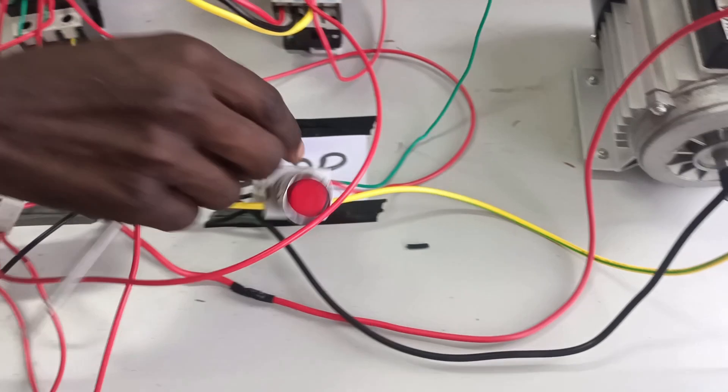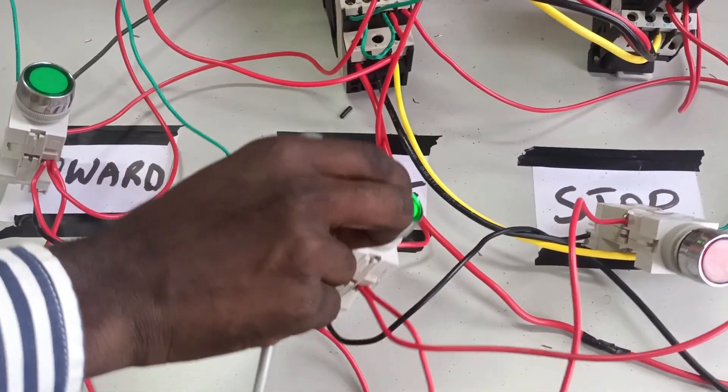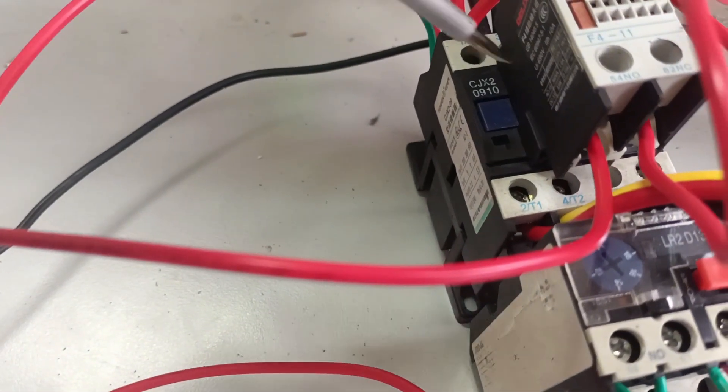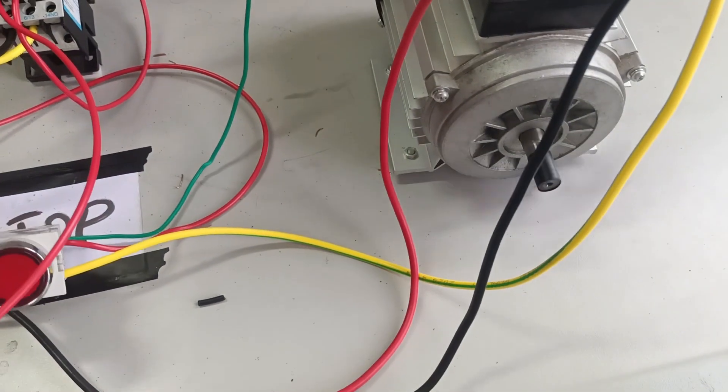You can now test the system — when I press the push button it lights up and the motor runs, showing the contactor energizing. I made a mistake connecting the stop indicator to pin 98 instead of pin 96, so it's not lighting, but the reverse indicator is giving some light as I've connected it.